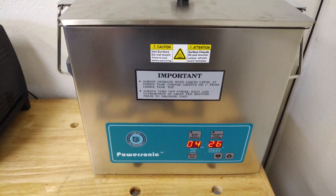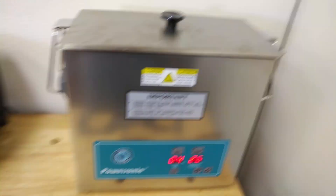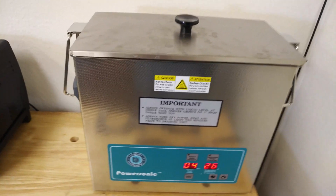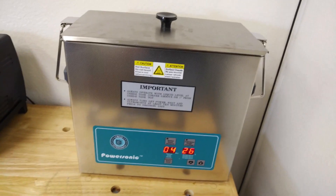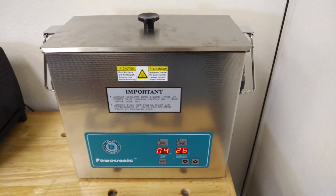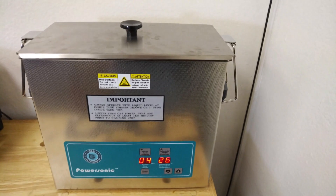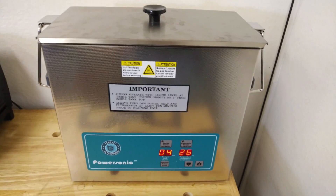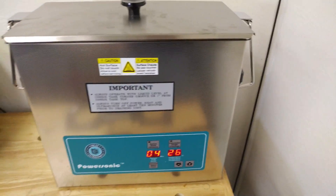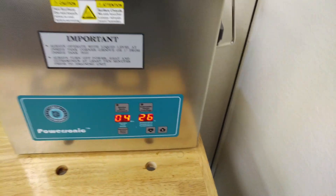Another very important piece of equipment in your shop is an ultrasonic cleaner. If you have a $100 ultrasonic cleaner, throw it out and invest in a better one. I previously recommended the Sharper Tech XPS 240 — it fit most MacBook boards and cleaned very well. However, the heater died after about a year. The Crest Power Sonic is now my pick — the heater takes about 30 minutes to reach 70°C versus two hours on the Sharper Tech.